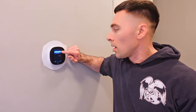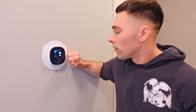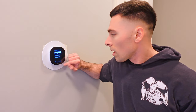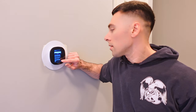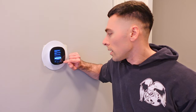The biggest question at the beginning is whether you're a homeowner or an Ecobee Pro. The Pro would only be selected if you had multiple green wires, which the instruction manual will explain. In this case we didn't have that, so it's just going to be 'I'm a homeowner.' It's going to detect what terminals you have wires plugged into and show what it's seeing, and you verify if that's correct. Then it asks Fahrenheit or Celsius preference, furnace or boiler — in this case I have a furnace. I'm going to have it control everything by the thermostat, name this one 'Upstairs,' select the Wi-Fi network, and go through the rest. After that it's pretty much just time zones and selecting what temperatures you want set for heating and cooling. The instruction manual will explain all the other features this device has. I hope you enjoyed this video — we'll see you next time on the DIY Grunt.